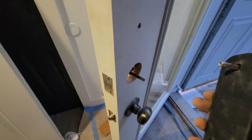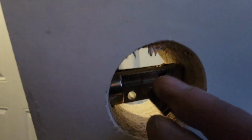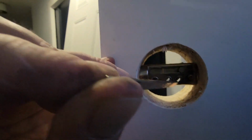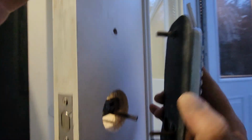All right, try this one-handed. So one of these pins come out because these have, let me show you, both holes right there. Set this down for the tailpiece from size to size. Like that's the 2 3/4 slot, and that is the 2 3/8 slot. So in this newer style, let me do this one here. I gotta start this tailpiece. You just drill the one hole up high.